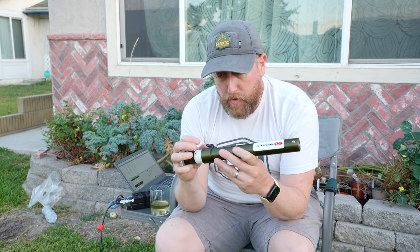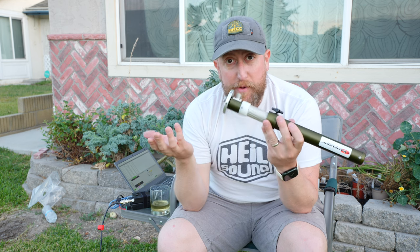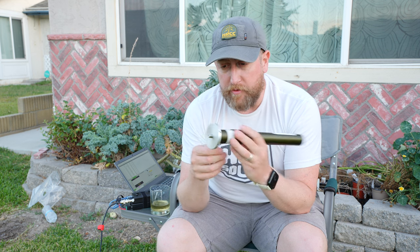These are compromised antennas — all companies that make coil antennas like these are compromised. This loaded area is called a loading coil — it's not fully resonating. The RF is not really coming out of here efficiently. What is resonating is that vertical whip. The more vertical you have in the air, the more effective and efficient it is. That's why we always say full-length wire in the air is better than a shortened loaded wire. We want to aim for the appropriate length of wire in the air. So you're paying for portability, you're paying for Chameleon materials. People sometimes complain about the cost — you're paying for quality. Look at other people's videos of Roltec — the quality speaks for itself.